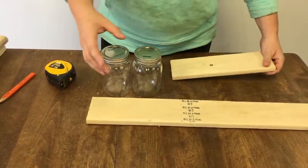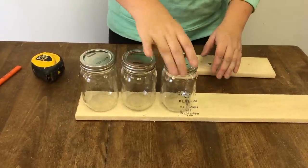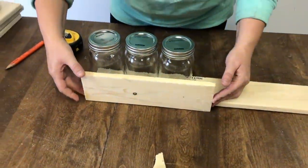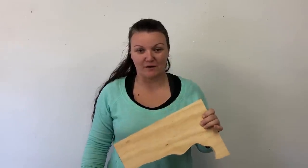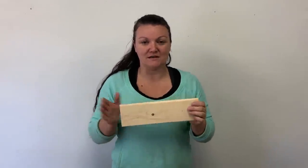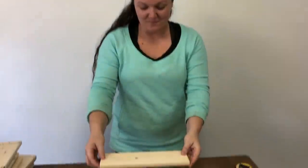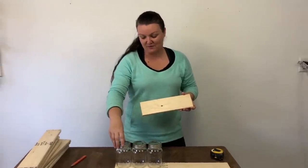What I'm going to do next is measure the width of three mason jars side by side — that's going to tell me the length of my little kit. While I was creating I realized I actually don't need the plywood for the base because the mason jars fit perfectly on the width that these boards already are. So I'm going to cut 10 inches where they'll fit together and then frame up the outside using the same types of boards all the way around, giving me a perfect little box for the mason jars. Being able to have them the same width as the mason jars is what I want — I don't want the mason jars wiggling around too much in the base.